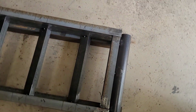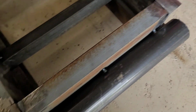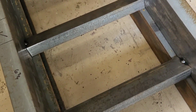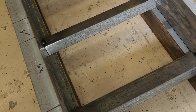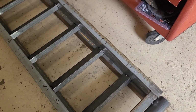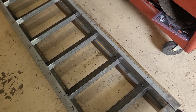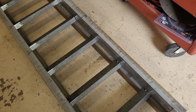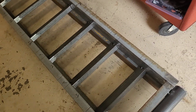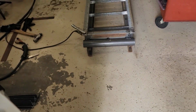So I'm going to go ahead and set up. So far, besides cutting all the metal down and getting everything pre-fit, I went ahead and put in the angle. And I opted to go with the 1x2 instead of a 2x2 because I wanted it to have a little bit different of a pattern going up it, just for traction. That was my own preference, but you can go with a 2x2 if you want to. That's your prerogative. Let me go ahead and grab the piece of metal and I'll show you that center strap that I was talking about.